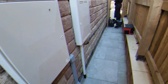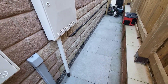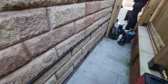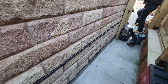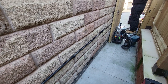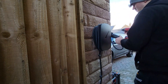We'll have a look outside at what we've done out there - just putting the cable holster on for the HyperVolt. Our cable's routed well away from any of the gas services, coming straight along this brick line as neat and tidy as possible. We've had to go for cleats on this - getting the Linian super clips into the mortar wasn't that easy as it's a bit soft, and the brickwork is a bit too uneven. So we've gone with cleats and concrete screws to get a nice fixing in. It passes behind the back of the gate and then loops up into the HyperVolt.